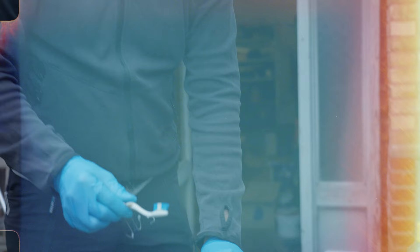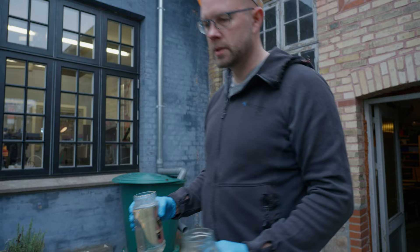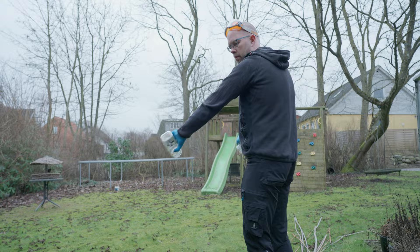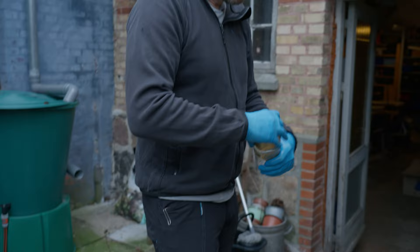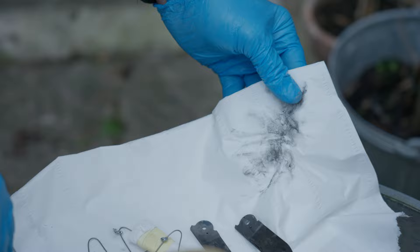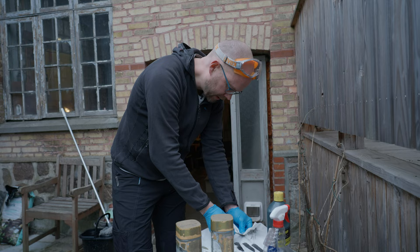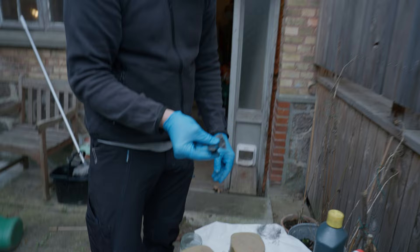Don't try this at home — I don't recommend doing this at all. This is just a process that works really well for me. This is water I rinse the blades in. Be really careful if you mess with this. I place the blades in thinner to remove the resist residue from the paint, which actually didn't protect the steel all the way as I wanted — this acid is strong. But it didn't go in deep in the painted areas, so I might need a little extra polishing there. Now we have the etched blades, but still unfinished — in a very rough state still.